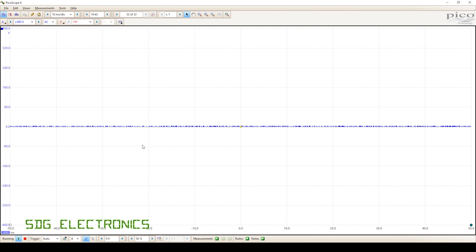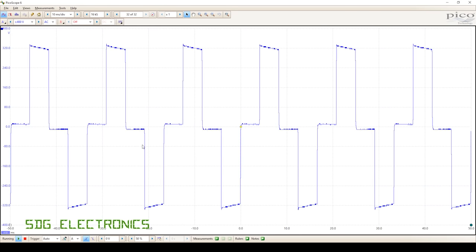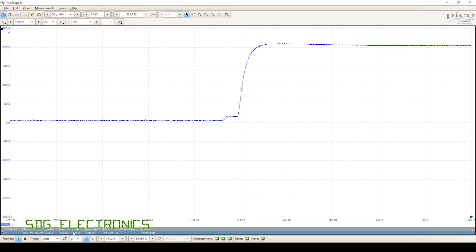Looking at what the output from the inverter actually looks like when running on battery — it's a little disappointing. It's not an actual sine wave; it's just a modified sine wave, essentially a square wave where the area under the curve is approximately equal to a full sine wave. Typically you'd want a proper sine wave created from a varying PWM waveform and then filtered. The rise time is somewhere in the region of 10 microseconds — around 100 kHz — and we'd typically see that radiated onto the output, potentially causing EMC failures for connected devices.